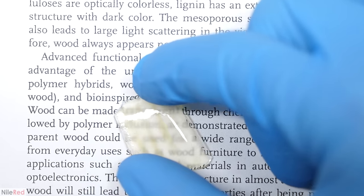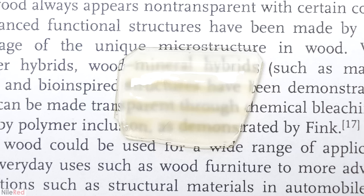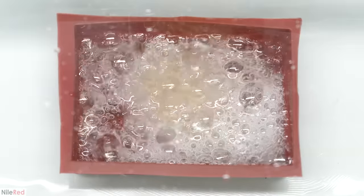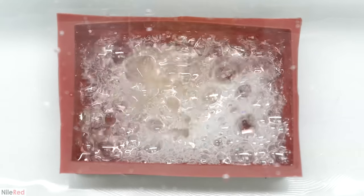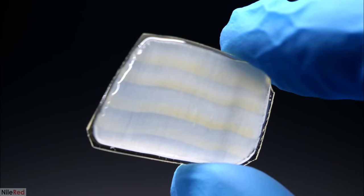I think that's about it. In general, I had a lot of fun working on this project, but it was a lot more difficult than I expected, mostly because there just wasn't very much detail in the paper. The overall takeaway is that for this process to work well, you need a good vacuum chamber, a pretty good vacuum, and to have the pieces as thin as possible. One final thing I never really mentioned: the reason these people tried making transparent wood in the first place was that it makes a strong composite material that's also transparent and comes from a renewable resource. The major issue, as we saw, is that getting the epoxy into it is really hard, so making larger pieces is going to be difficult. In the future I might revisit this, as I still want to make a large piece - starting with the same 2mm thickness but with a really large face, then maybe moving into thicker or weird shapes.